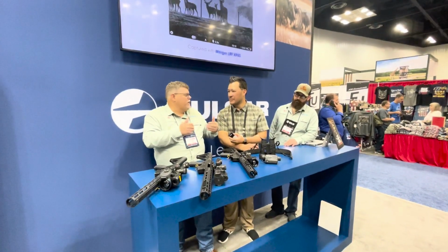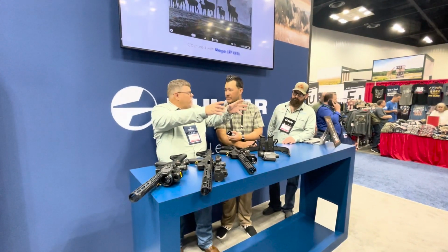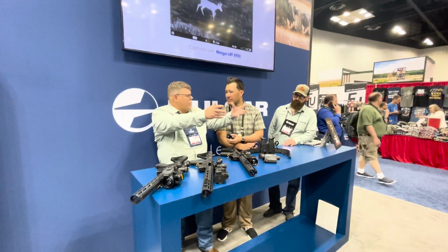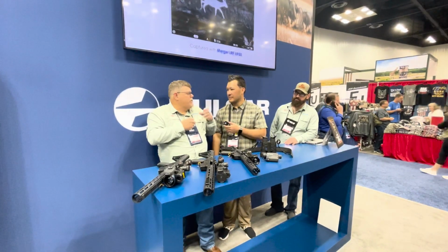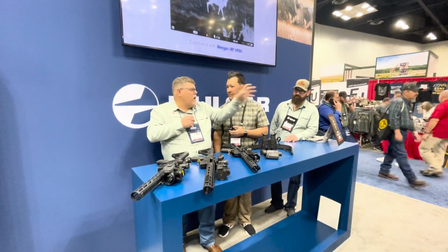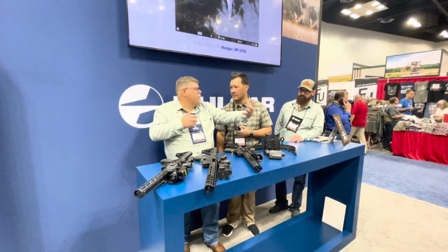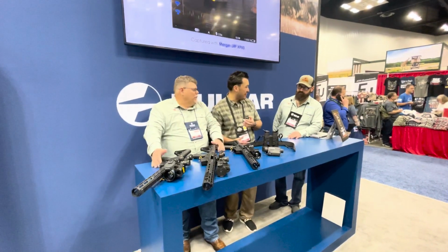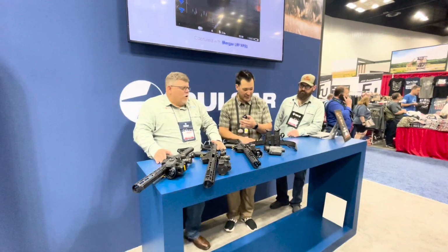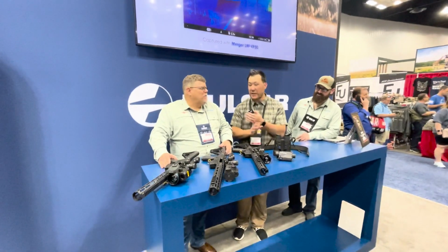Well, thermal doesn't work like that. Thermal sends out a sensor array to detect infrared radiation, which is heat or differences in temperature, and brings that information back into the unit. So instead of casting IR illumination out, it's reaching out and grabbing infrared radiation and bringing that information back. Okay. So yes, very, very different setup. Okay, perfect. So hopefully I said that in layman's terms. I think it makes sense though, for sure.